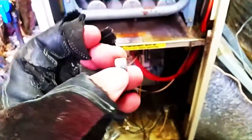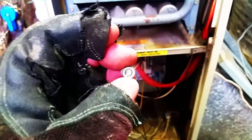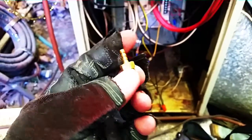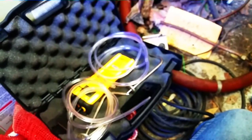There's our fitting that comes off the gas valve. We will use a fitting that comes with the manometer to put in its place so we can test gas pressure. I'm going to put this piece on and the hose will fit over the top of this barb so we can hook it up to our manometer, which is a Field Piece manometer.